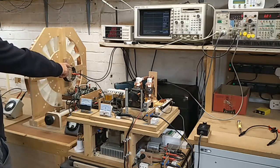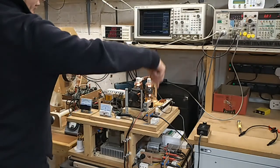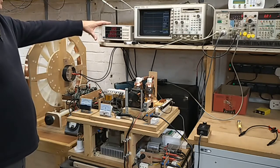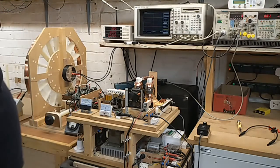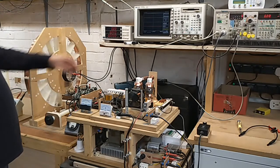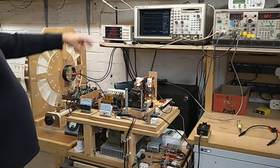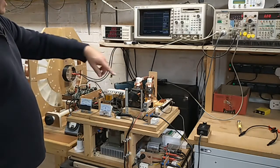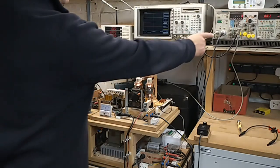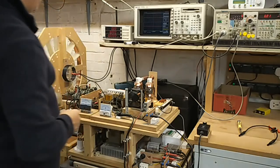The pickup used to drive the valves is on the back here. That feeds down into the grid on the valves. Up top we've got the power meter, which shows the input power coming to the high voltage transformer — we're just using one transformer of the three here. The oscilloscope yellow trace is showing the voltage across the primary; the red trace is showing the anode current flowing through the tube, which is also the current flowing through the primary. We also have a Tektronix counter timer showing the frequency output.